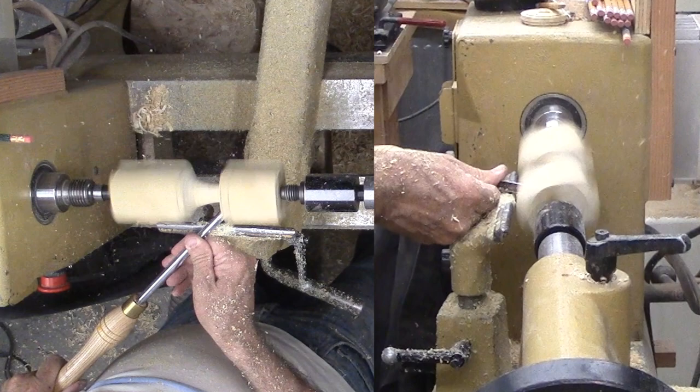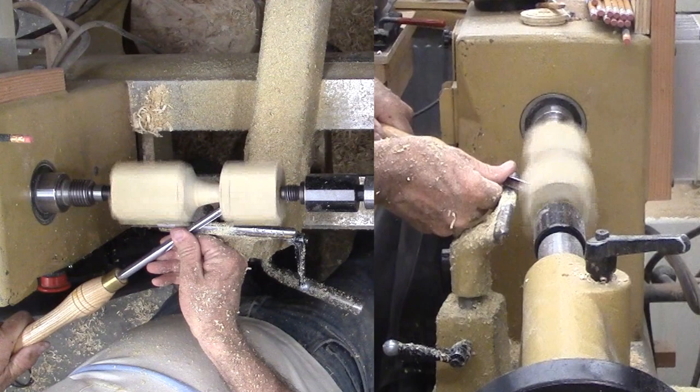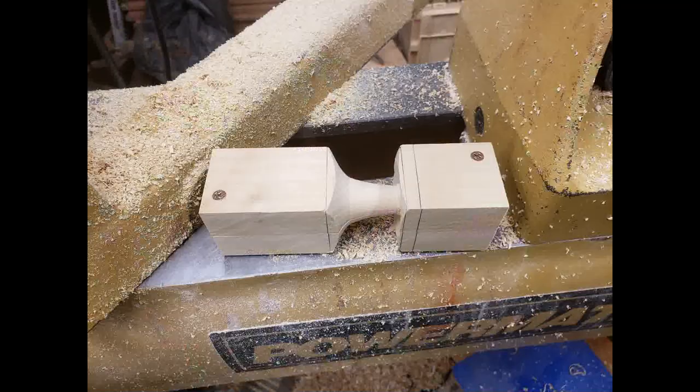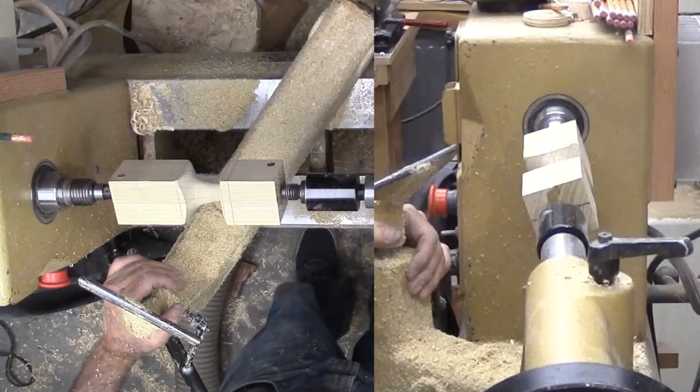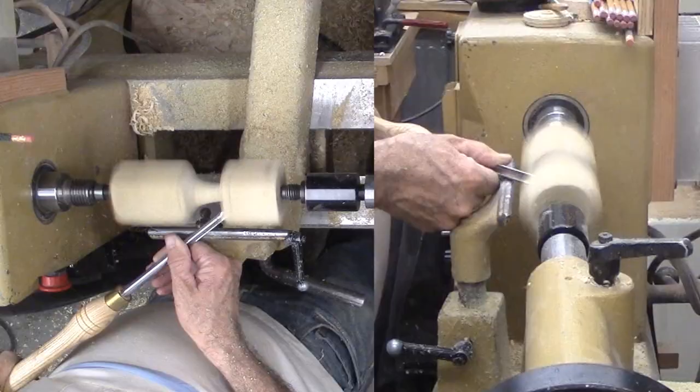Oh no, do I need to start over? In the end I was able to align the wood again, but this time drove screws from both sides into the other piece near the end. Since this is a two stave piece, this works out great. Back at the lathe, I keep at the undercut with my small gouge but switching over to a round nose scraper. It is a little undercut — let's see how it turns out.